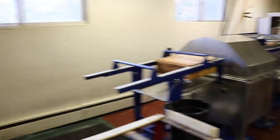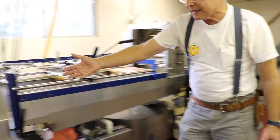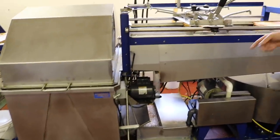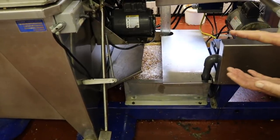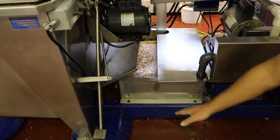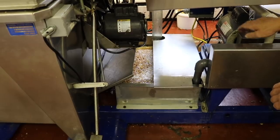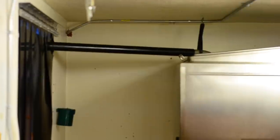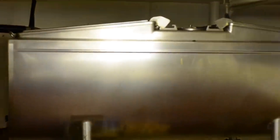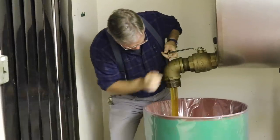We'll go back here and look at where the honey flows in this system. We've got honey coming out from the capping spinner and honey coming out of the extractor. They both feed into what's called the sump tank down below — I've opened the cover up so you can see inside. Wax floats to the surface and there's nice clean honey on the bottom. When that tank gets full, a float lifts up and turns on a switch. That switch operates a pump that pumps the honey up through a hose and over into our settling tank in the hot room. The hot wax in the settling tank floats to the surface, and we take the nice clean honey out of the bottom to fill up barrels, then process the honey or store those barrels.